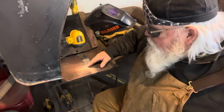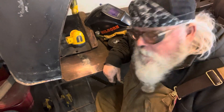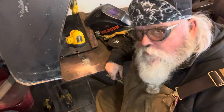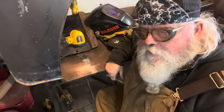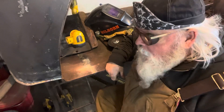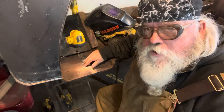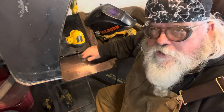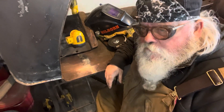Back to this repair: I ground it out all the way down, full penetration, and preheated it to about 300 degrees. I used 3/32 aluminum bronze filler metal at about 100 amps DC straight polarity, with a 3/32 tungsten. Either brazing or 99 nickel is the only way I've ever repaired cast iron before, and I've done a fair amount of it. So I was really interested to try this out.